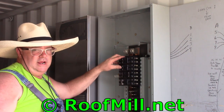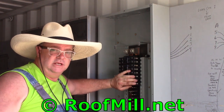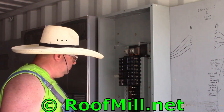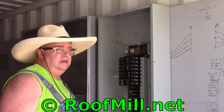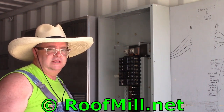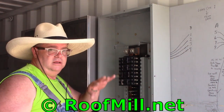This is a 400-amp, 240-volt panel. This panel is twice the capacity of most modern homes, which are 200-amp, 240-volt. This is 400-amp, so we've engineered this whole system to have a lot of extra bandwidth and AC bus to be able to support doubling the size of the system at any time in the future without redoing all of this main panel and all this new panel.